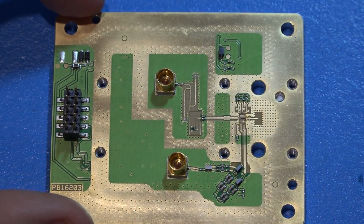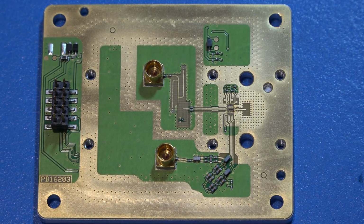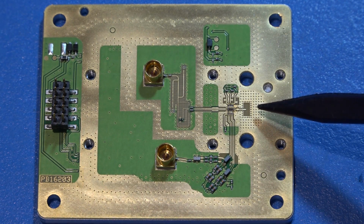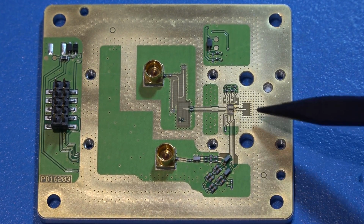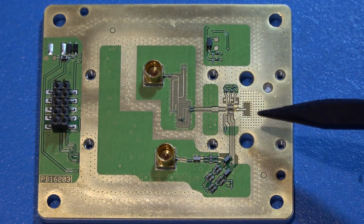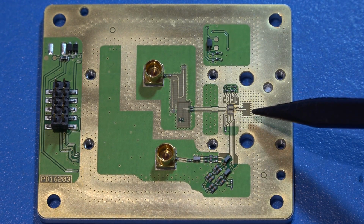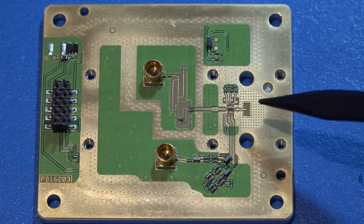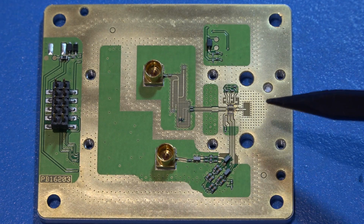So, and here's the board. And take a look at it. It is absolutely beautiful, very nice, custom made, and we can start to analyze it and see what we can get. So obviously we're going to have the waveguide to coax converter. This is a very common technique to do this, where you have a back grounded piece and you create a conversion from the field going into the waveguide into a coaxial converter, and you can see nice ground stitching around that. The dimensions here are too small to machine this piece out, but you can actually machine the PCB material out so that you have better conversion and lower loss, because that's just going to contribute to dielectric losses. But you have no choice in this case because it's so small.